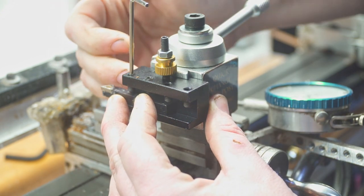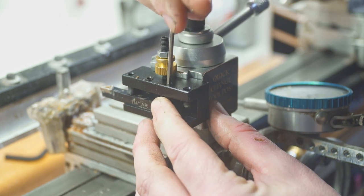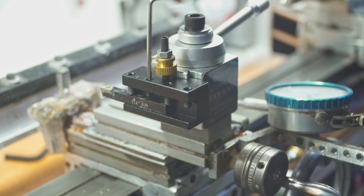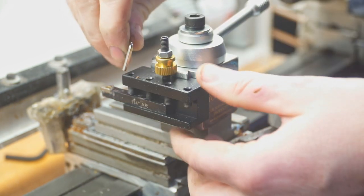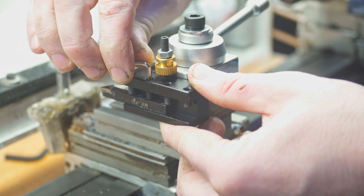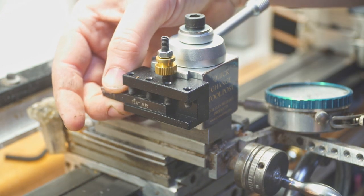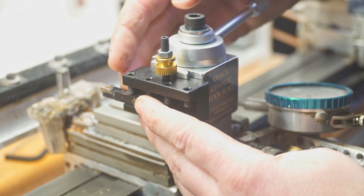You just put the bit in, make sure you're against the back of the tool post, get lined up where you want to be, and tighten down the set screws. You might have to shim these if centering gives any trouble. One great thing to use if you don't have shims is cheap feeler gauges. I know guys who have used cutoffs from aluminum cans — I believe the thickness is around three thousandths, though don't hold me to that. Now that this is on, I'm going to go through the process of centering the bit to a piece of round stock.